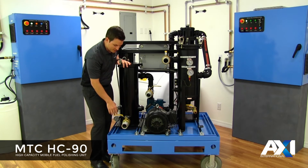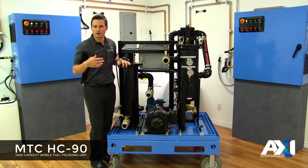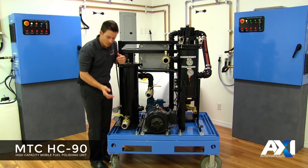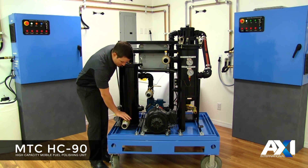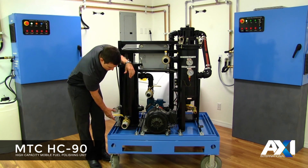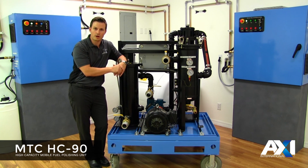This will be your final cycles — however many it takes to get to the required ISO code. It will really depend on the tank quality, the fuel quality, how long it's been there, and a number of different factors. This ball valve will basically control whether you're actually going to discharge or not. We give two gauges here so you can see the differential to make sure that your filter is staying within the clean zone while you're operating.